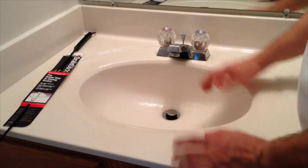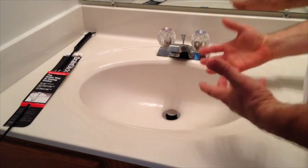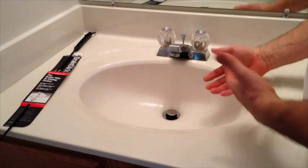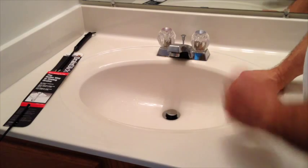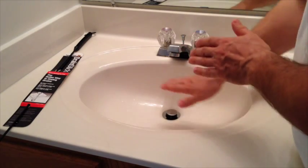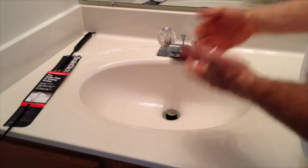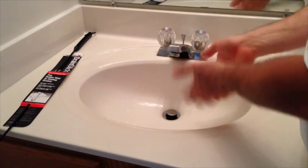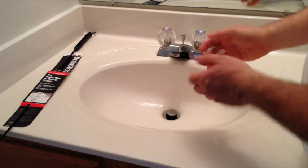One way is to use chemicals — you pour it down in there and let it dissolve, let it work. But you may not have a comfort level with chemicals. They could splash up, get on your skin, get in your eyes, and you may not be comfortable with that. Another way is to take the piping below out and take it apart and actually clean that out. But again, if you don't know what you're doing in terms of plumbing and taking piping apart, you can run into some problems as well, and you may not be comfortable with that.